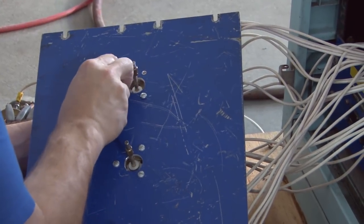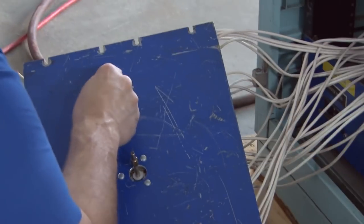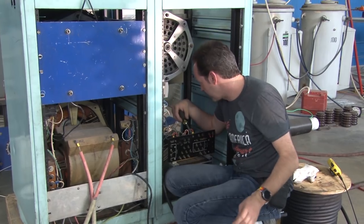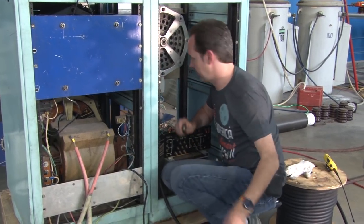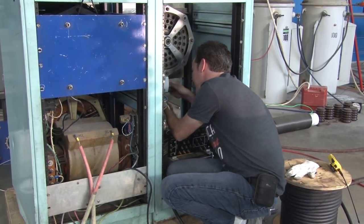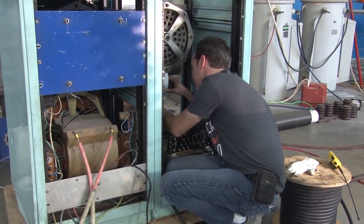In the event of a high voltage fault on the transformer doing something bad to the cabinet, what I'm going to do is connect the transformer so that the case ground on that is connected to RF ground. Yes. That'll work.